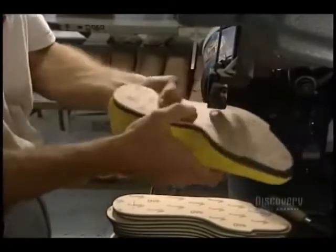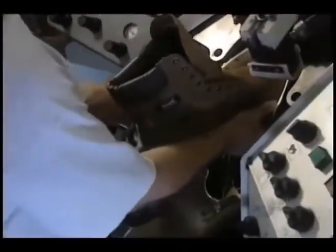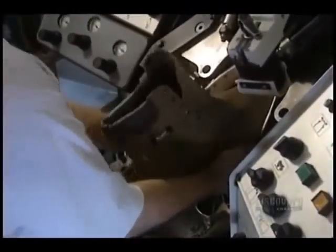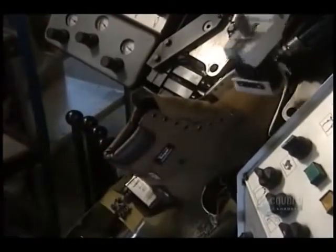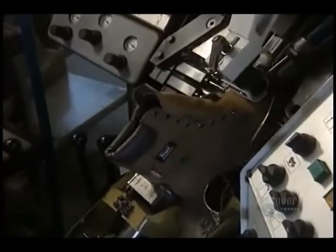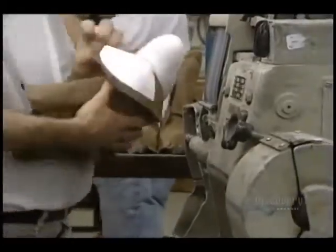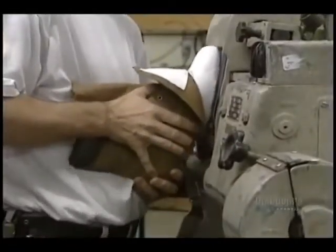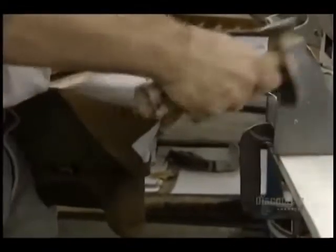Here they attach a foot mount on a form with tiny nails called tacks. The last is placed in the boot to facilitate the assembly of the front part. This carding machine removes any unevenness at the level of the lining before proceeding to the next step. They now install the tempered steel toe cap. The lining is pulled, they insert the cap and fix it well in place.